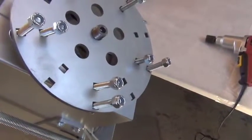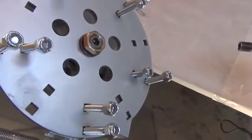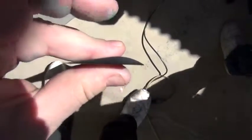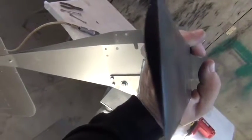Now that that's done, we can put that on. We put in the washer and the nut to hold everything in place — we're not going to tighten it yet until we get the blades on. Now the blades will look like this. There's a flat side and a round side — don't look down here at the base because everything looks the same. To find the flat side and the round side, you will have to look down the blade. You can see that the flat side is where my thumb is and this is the round side — that's how you tell. The flat side must face the wind, so the round side faces the tail or the PMA.